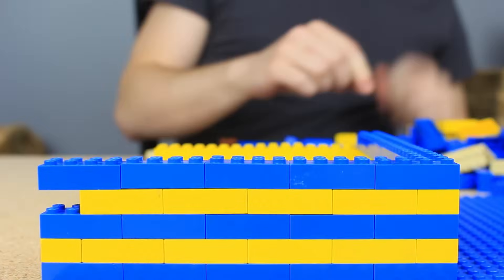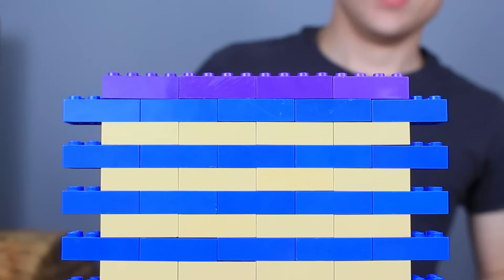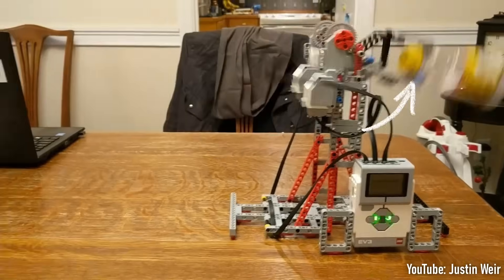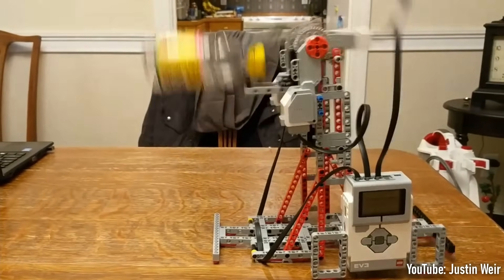Task one was the least of our worries, so we stacked dozens of 2x4 bricks for the prototype. Then we installed a motor on each side to suspend the gripper motor in the middle. One thing the other bottle-flip robots taught me is to first pull the bottle backwards to get a running start, then have the gripper open while it's swinging. We made sure there was a good distance kept between the back wall and motors, and then the easy parts were over.